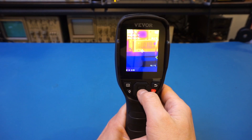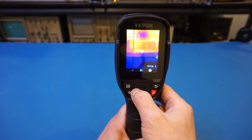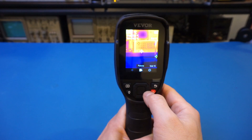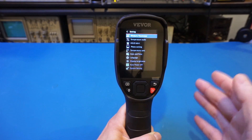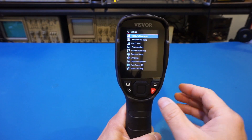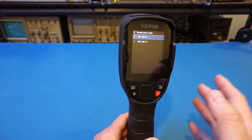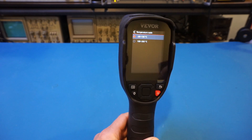The menu is actually quite intuitive on this unit, and largely similar to other thermal cameras I have reviewed. You can get to the menu by pressing the middle button and cycle through the items. Although the SC240N has a specified temperature range between minus 20 and 350 degrees, it actually has two different temperature ranges you have to select manually. By default, the range is set between minus 20 and 150 degrees. If you want to measure a temperature higher than 150 degrees, you will need to adjust the settings to the correct range — otherwise the thermal image would be oversaturated.